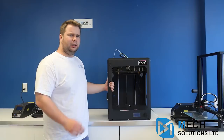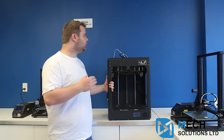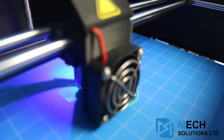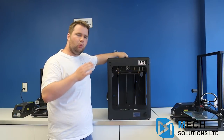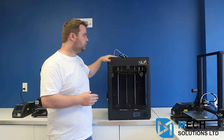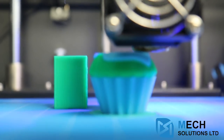A lot of people ask: if it's a dual extruder, why doesn't it have two nozzle heads? The reason is it's actually advantageous for the CR5S to have just one nozzle head. With two nozzle heads, the idle nozzle can sometimes knock over a layer that the other nozzle laid down. The other advantage is that when two filaments go into the same nozzle at the same time, they can actually mix colors — whereas most dual extruders can only use one filament at a time, color mixing is a possibility with the CR5S.